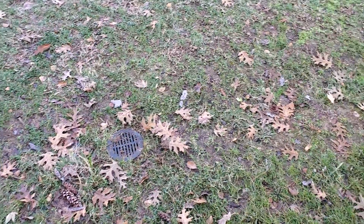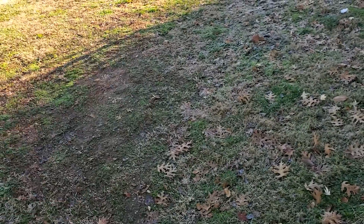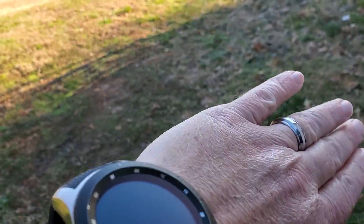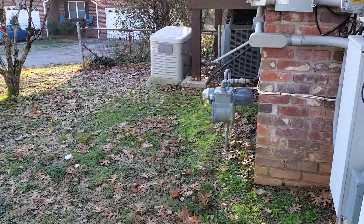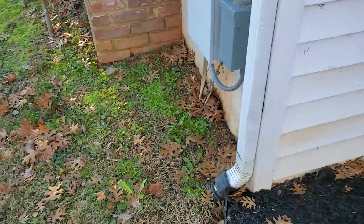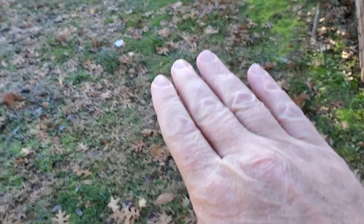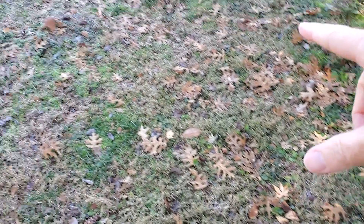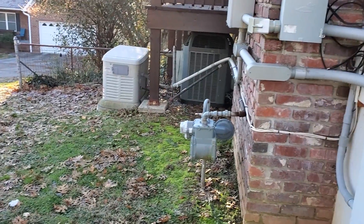You can even create multiple drain openings if you like, but they felt this was good enough for this small yard. The water gets directed all the way around — there's actually a rise that goes up that way, so they caused the water to go down the hill past the yard. They also took this downspout right here, which was draining right by the foundation, re-sloped the area away from the house, and tied the roof water into the French drain to go down the hill and off the property.